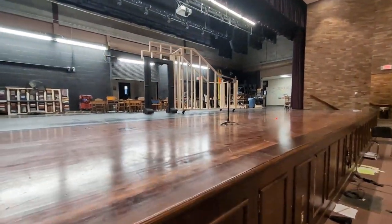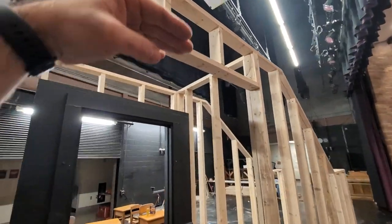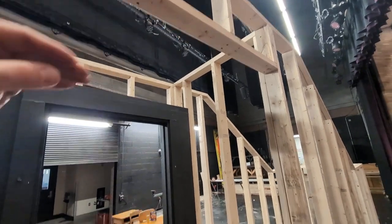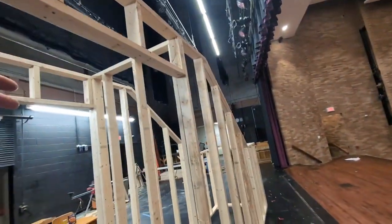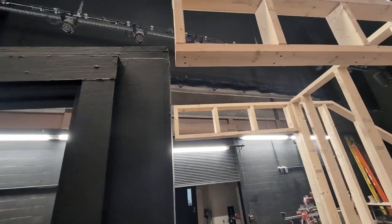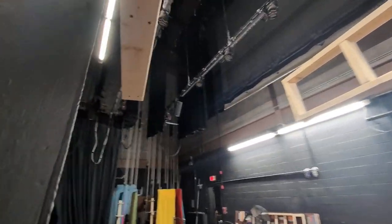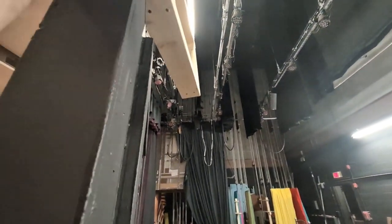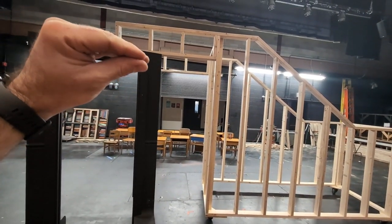And so, some other considerations now, technical considerations. If you are going to park this other set piece underneath there, we can't see up in here. We're going to put Luan on that bottom surface of the set to create essentially a ceiling, because people are at a low angle here and they can see up, and you just want that to be a smooth surface. Which means building this geometry so that this existing set fits under it almost perfectly. When you have a bump in the floor, if I just pick up on that, she'll go, yeah, see? So it's the exact right dimension and overall height. Well, that's good if we want to attach this piece to that, because we're not pulling it out of square when we close a big gap.